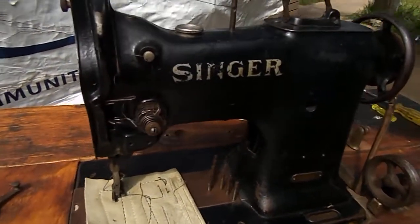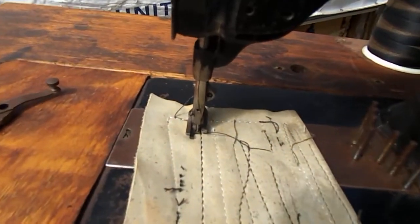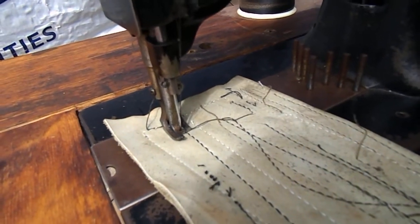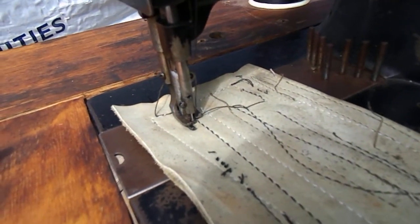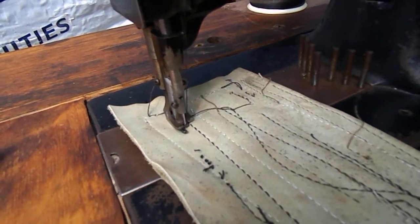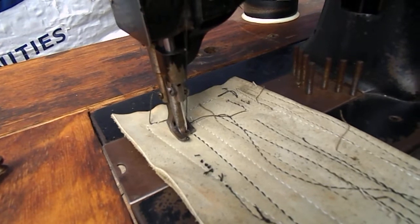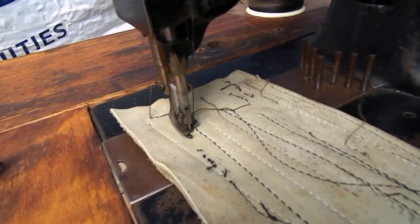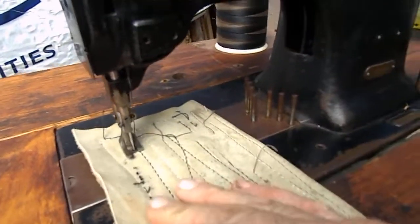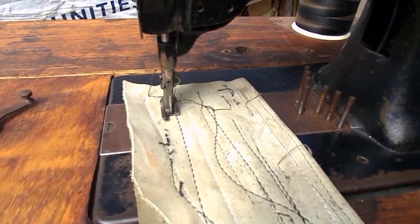A very, very robust looking machine. And this here, if you look closely, it's actually got the walking needle - not the compound feed, but it actually used to be called vertical feed. You can see the needle walks forward, and then the needle and the foot walks back with the feed dogs to create a very similar thing to the compound feed.